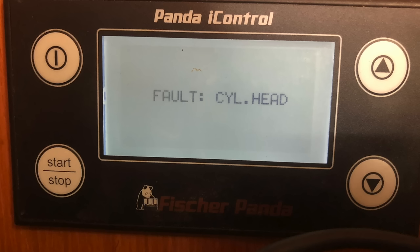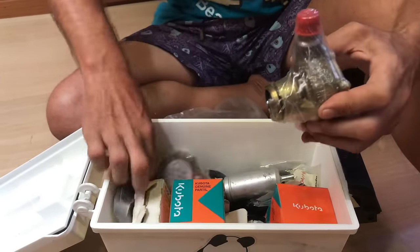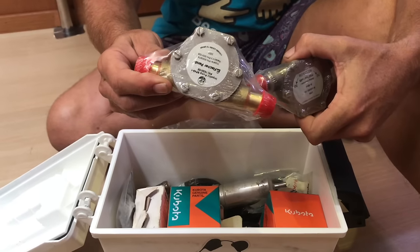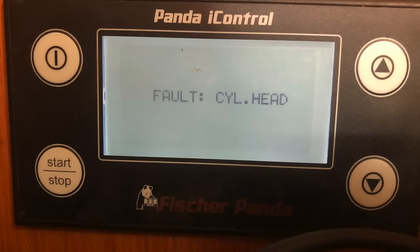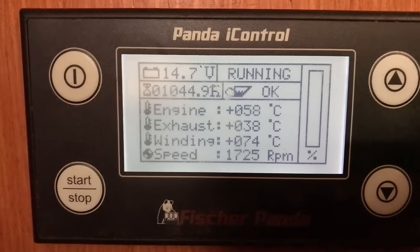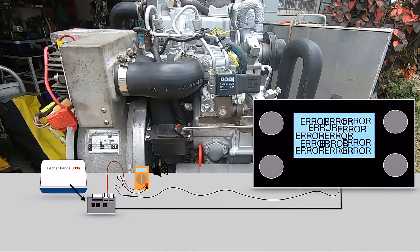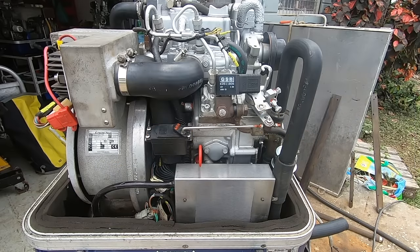You basically cannot trust the error codes that appear after a forced shutdown. This one might as well be due to problems with the water pump — I will come back to this, as this is another component creating tons of problems. A scary message, yet most likely it was just the first available message in the machine codes. Since there are no error codes on the display while running without the throttle servo, it's plausible to believe the imaginary error codes only come after the engine has been forced to stop — meaning it's a serious software problem. Temperature or oil sensors will legitimately stop the generator from running, even without this link connected.